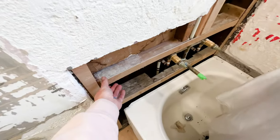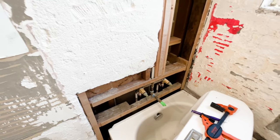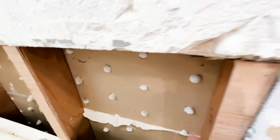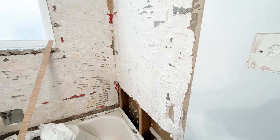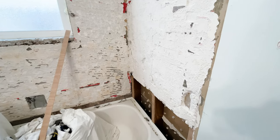I'm also having to shim out the walls a little bit to be able to add the drywall in so it'll be more level, rather than putting kind of two sheets of drywall. As you can see, I've done it over here — this one's ready to go. That one has quite a few shims and this one only has one that was needed to match the level of the actual walls. I know that's going to make my walls not square, but that's what I'm working with.